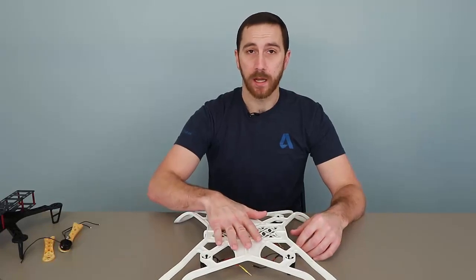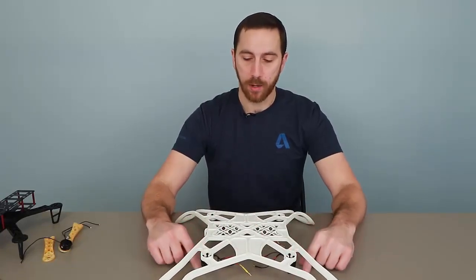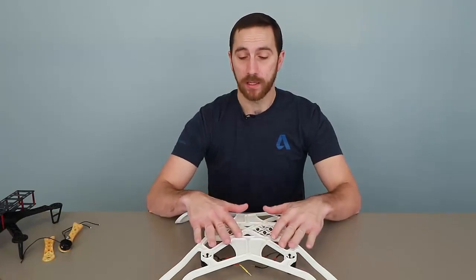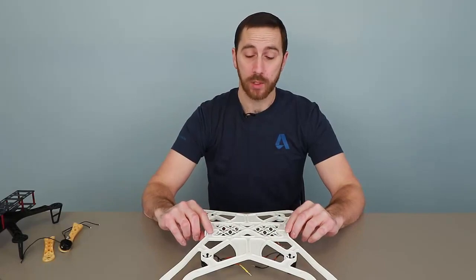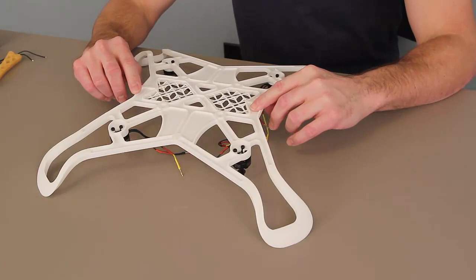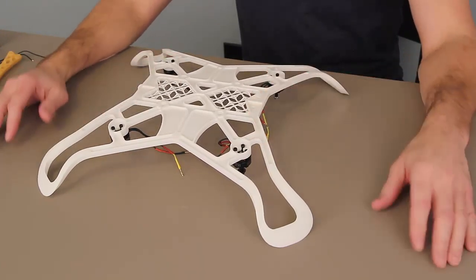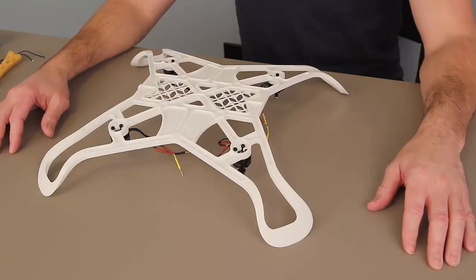That's a big difference between a lot of the off-the-shelf components because our motors are upside down and the props are facing down. It means that we can fly directly up to a ceiling without fear of crashing or damaging any components. So when you consider designing your own airframe as opposed to buying an off-the-shelf one, you need to consider what's available and what type of functionality you want to add that's not currently available.